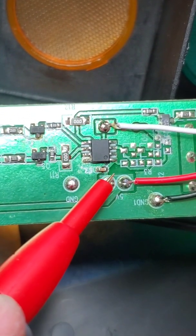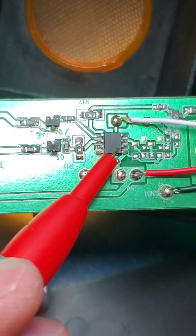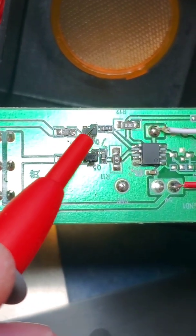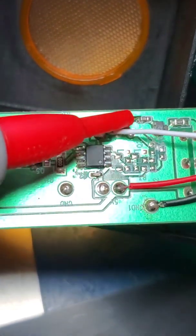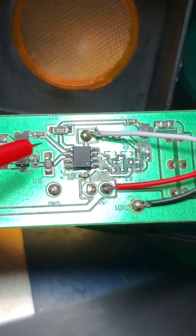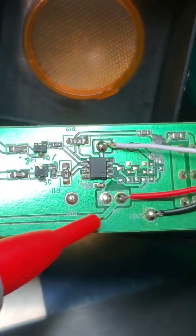The plan is simple: I'm gonna cut the power to the IC by cutting the trace here, so this one gets power. And then I can use this input to wire directly — wires here, and here, and here. So I'll have the signals for the 3 LEDs from there, and I can keep the power supply from USB, so it can drive the power for the LEDs instead of drawing power from the MC.